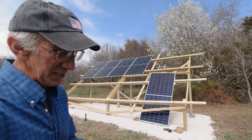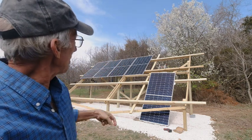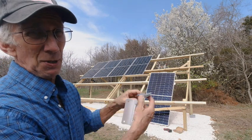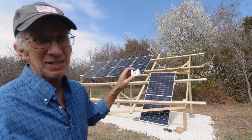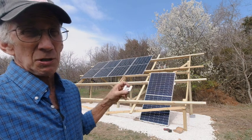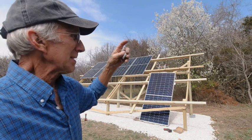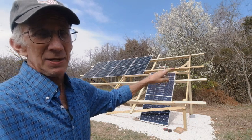I'm actually double fastening at each connection — first with a Renogy solar panel connector. You can see up there that I've already done that on those. And then after that, I'm connecting additionally with this one here. It's got some teeth on the back that are supposed to bite into the anodizing on the aluminum to make an electrical connection, which would bond all these together. I kind of wonder if it actually works, so I am also going to be running a ground wire that will connect all 12 panels together, going to the ground rod I've already driven and then through the conduit into the house to tie into the ground on the main panel.